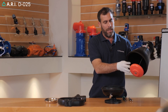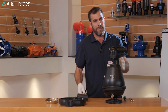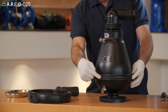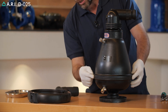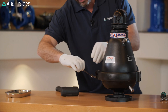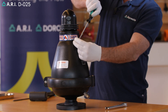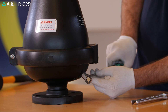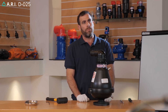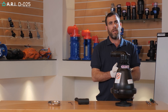We're going to return the top assembly to the base. If there is a gap we could use the assistance of a plastic hammerhead. We need to make sure that the base and body are aligned together and sit perfectly. We're going to put in the clamp set and close up the unit. We're going to close the drainage ports and gradually open the isolation valve underneath the product. We'll check the product seals tight and you can re-commission the product back to service.